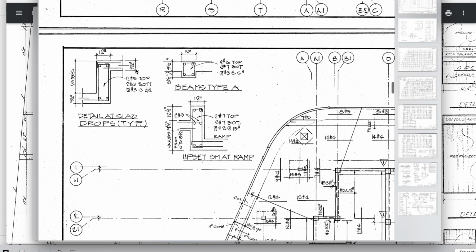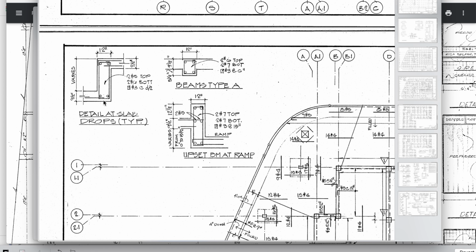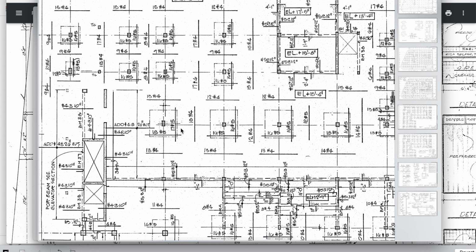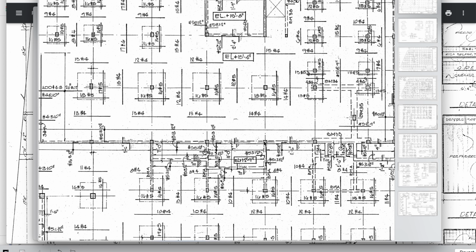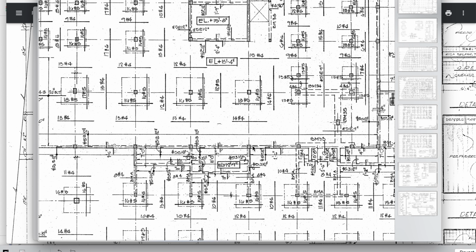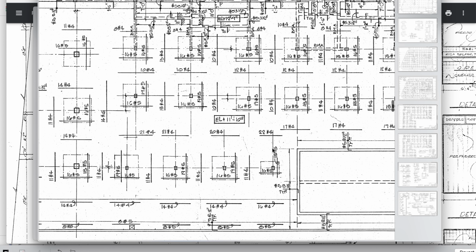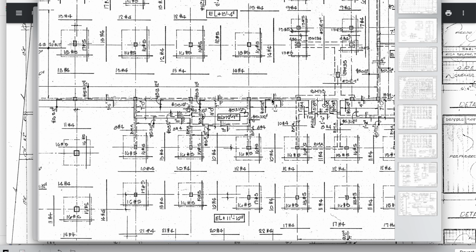You see the decking here is 9.5 inches, and it has one piece of rebar tying it in, and then another piece of rebar tying it in a hook fashion, depending on how far that is as this went down. If this went down between the L and M, it could pull this down and flap it over, but I have to have it flapping over around this L column right here, and then stopping right about there. That's not quite where my construction joint is. I believe my construction joint is here, and the video presents like it's way back here, but I think the construction joint is out here, and that puts us pretty close to crushing a car.